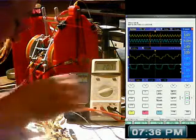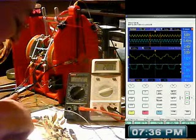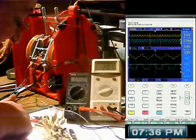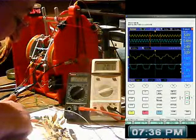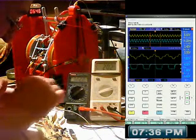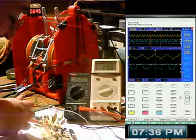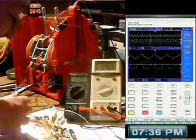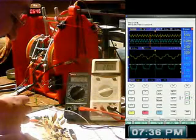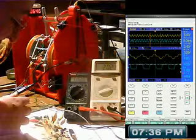Yeah, it's all about timing. This is what I'm working with, to try to manipulate the timing. But it basically still works by the voltage level on the trigger coil. So the trigger coil itself gives me the timing adjustment. So it seems like keeping the very basic circuit is all I need by the looks of it, and that's what I was trying to figure out.